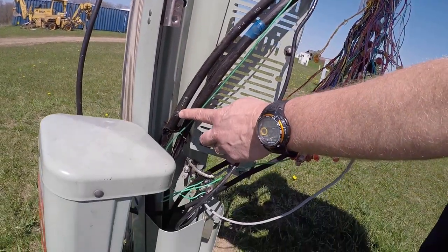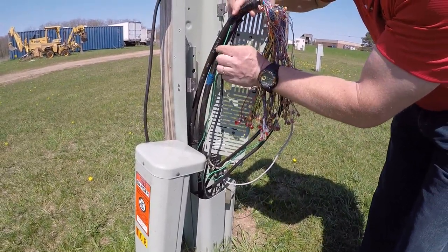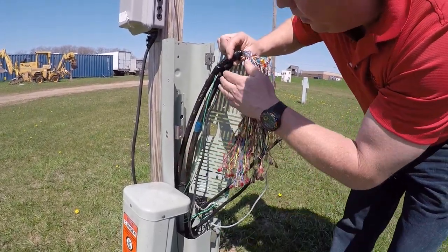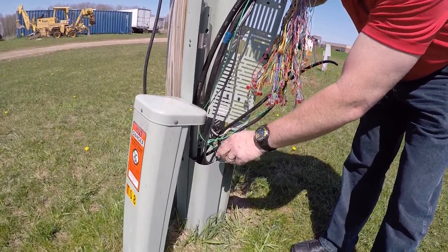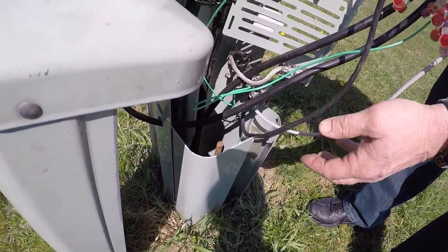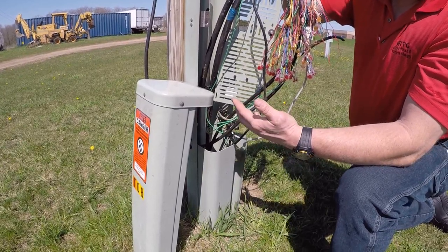Here is the telephone designation cabling and the manufacturing type. Also on this cable we have identification and bonding and grounding. We have a grounding strap that's actually bolted on here with an alligator clip, which we showed in some of the other videos. We also have bonding cable on the other side that shows two different styles that goes to a ground rod — you can see the ground rod way down. Those are all bonded and grounded. The reason why we have grounding and bonding is twofold: one is for any type of electrical surge, lightning, or any type of surge — maybe a power line with stray voltage.